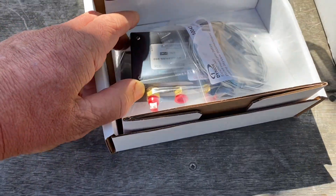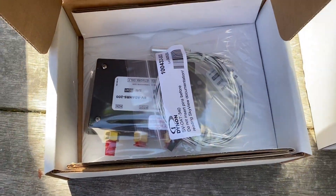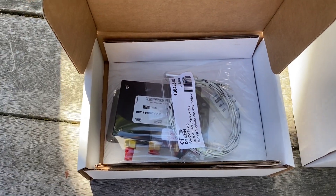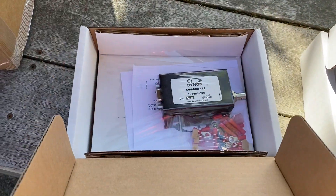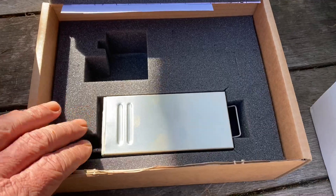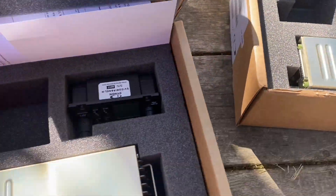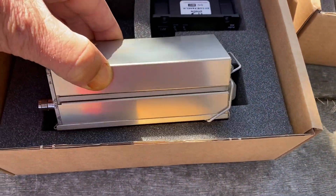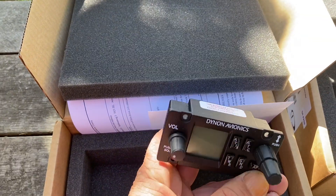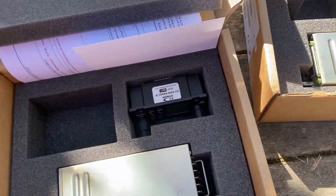This is the ADAHRS — you can see just beside my hand how small it is. It has to be mounted level and also has a wiring harness with an air temperature probe attached, which will probably run up inside the wing. Another tiny unit here is the ADS-B receiver — that's for picking up traffic and weather. This is the transponder module, the SV-XPNDR-261 — once again, blown away by how small it is. Comparable in size to the VHF comm — that's the comm unit that'll go in the avionics rack, and this is the radio head, a very neat little unit with a notably small depth.